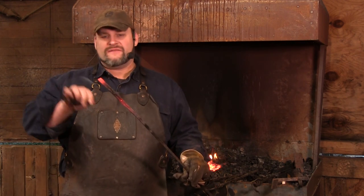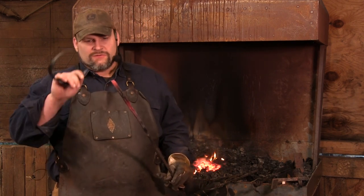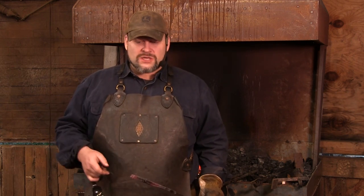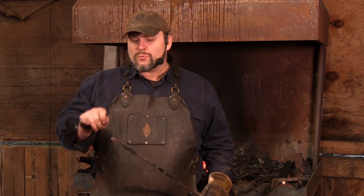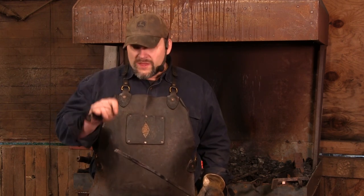We now have our handle attached to our shank, everything sealed up pretty nicely. Now we can go back here and start working on the hook. For the hook I need about five inches of taper — I measured this by taking a piece of wire around the mandrel I'm going to use. You can also do this over the horn of the anvil. Now, since I fused this together but it's still got a little movement to it, on this first work I'm actually going to bring it up to welding heat again just to make sure everything's nicely fused — it keeps us from having a possible separation, which is always an issue with these.